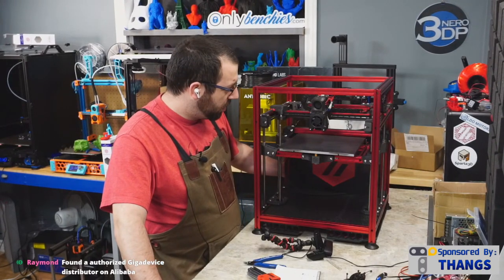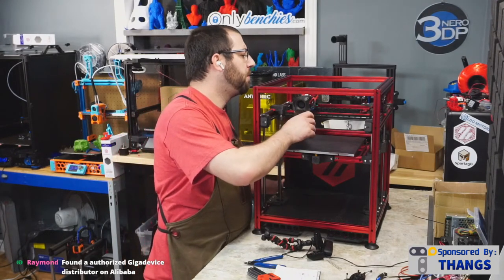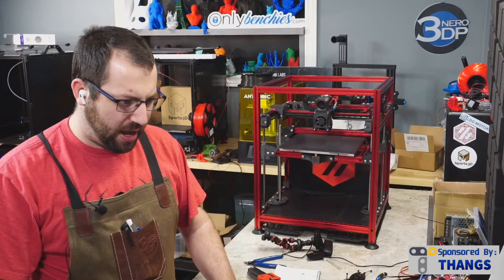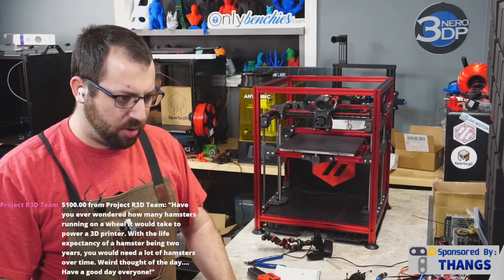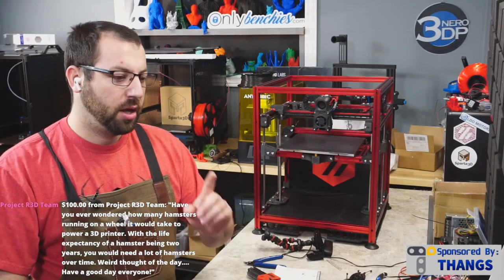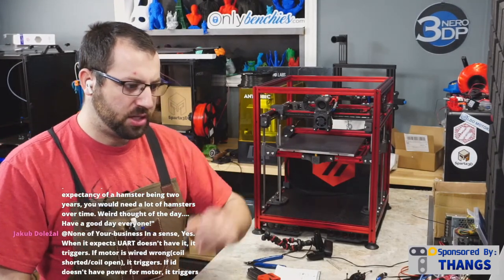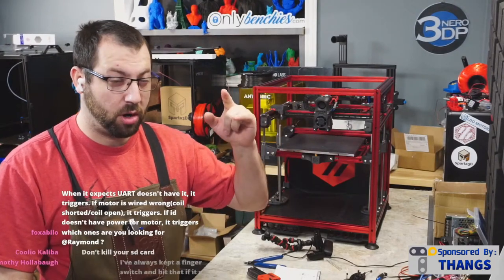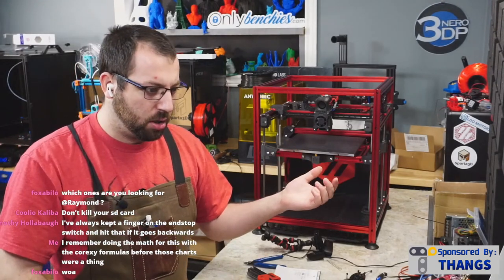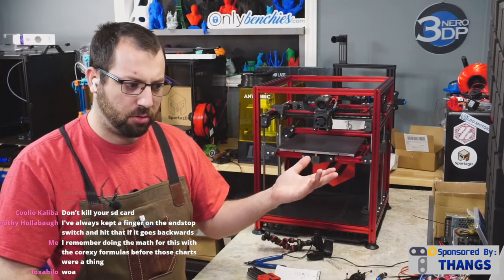Okay, X, go home. Going the wrong way. We're going the wrong way. Let's take a look here. So X was going backwards. And I'm assuming Y is too, because I have my motors backwards. So I'm going to invert both motors in the config because I actually did put them backwards. The default config has the A motor being the Y motor. I like X because X is lower, Y is lower. A and X are lower letters, numbers.